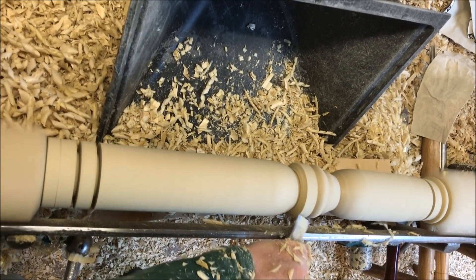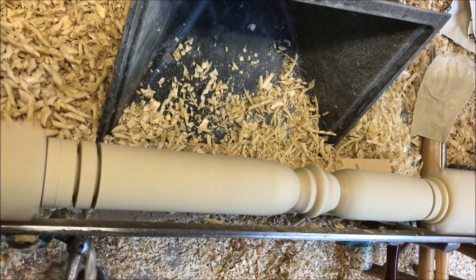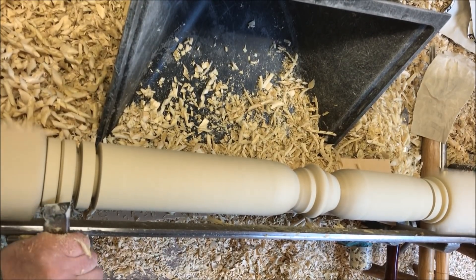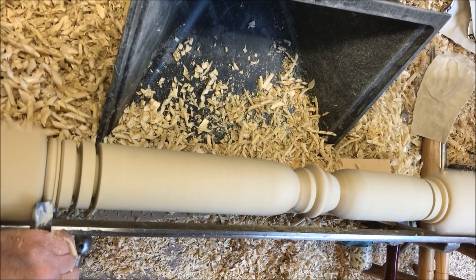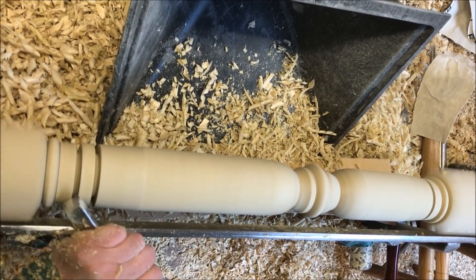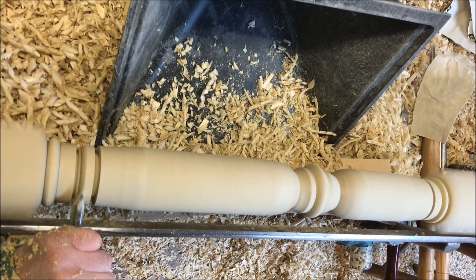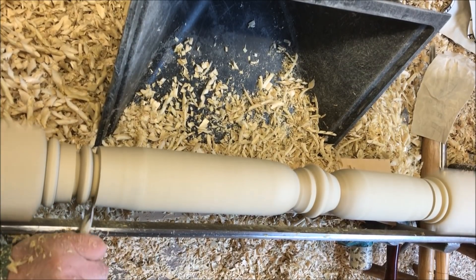Then this side has to mirror the other side of the bead. Down here this bead is reduced, and this one again is close to the pommel, so I use my point. Move the handle — you can always do that with a gouge. With that reduced bead there, I'm confident from experience of getting that smack on the right diameter. If not, you would size it beforehand.